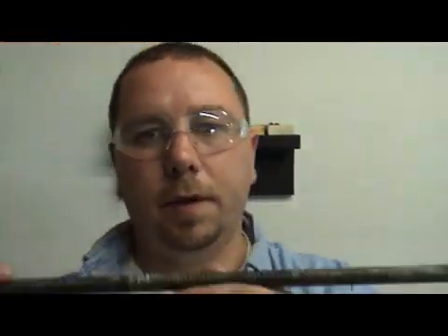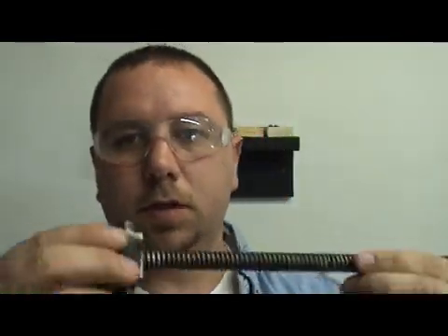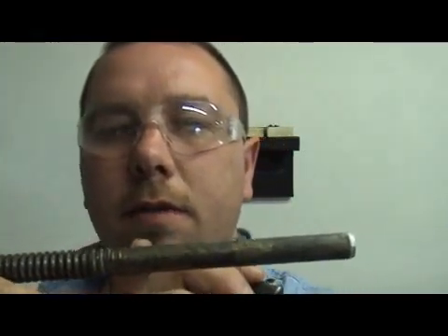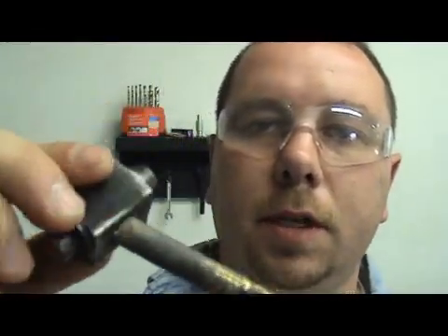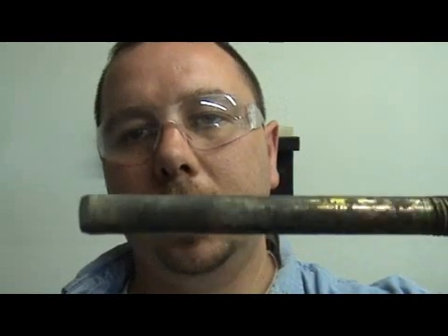So here's where we're at — we have our screw and our nut that goes with it. This screws onto this part, and when it gets down to this thicker section with no threads cut in, it won't go through the hole. So what we have to do is machine this down on the lathe to get it a little thinner, so we'll be able to take it in and out of the pot as needed.